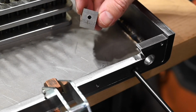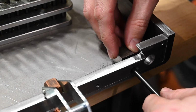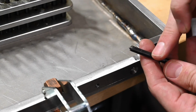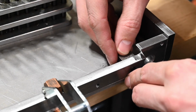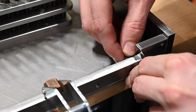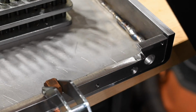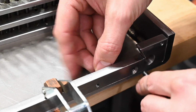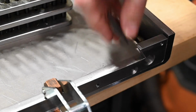So that was a bit of a failure, just not thinking, putting that hole in the center. A little bit of a screw up, but no big deal. The way I got close anyway is with a transfer punch, getting it in there to where it was just touching the part, and then running the part back and forth across it to make a little line. I measured that, got some gauge blocks, and found the right combination. So we are 229 up from the bottom. So that's what we're going to do on the mill.